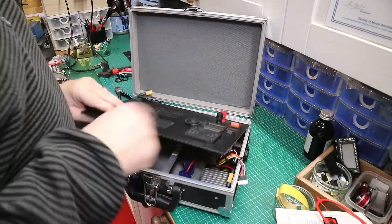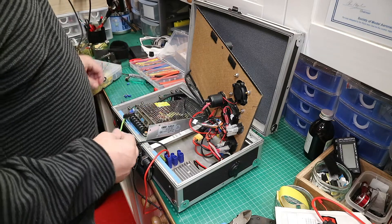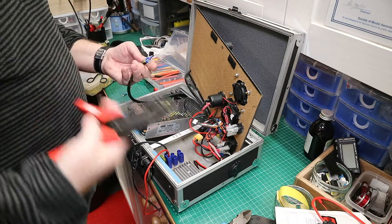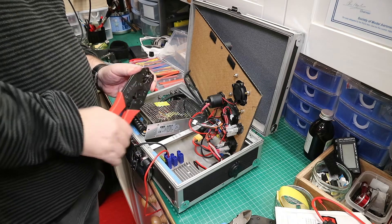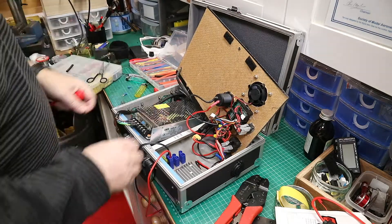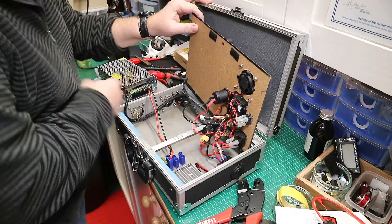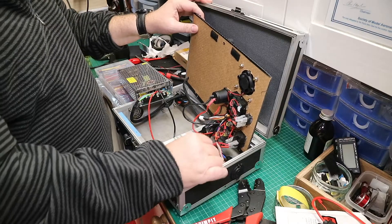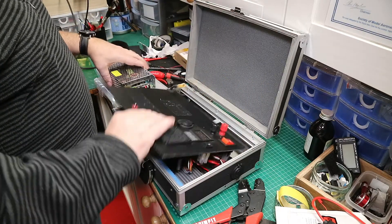There's an IEC socket there for the mains connection in the back, out the way - two air inlets and the fan there. I've made a mains lead with crimps, using regular crimps that you'd buy from your local car accessory shop. I've got a ratchet crimper, which is a bit more robust and stronger and gives a better crimp. Simply put the wire on, lock it in the crimper and squeeze it. Before I fix it in, I'm going to test it - check everything you've done and make sure everything's connected right. Live and neutral is going to live and neutral there on the earth. Positive and negative is in the right place, and it's going through onto the switch, so the switch will put power onto these terminals that feeds everything.